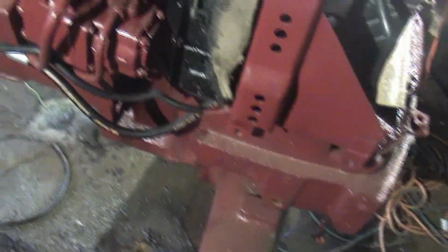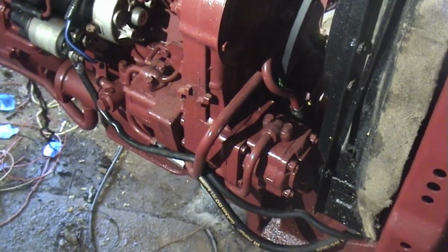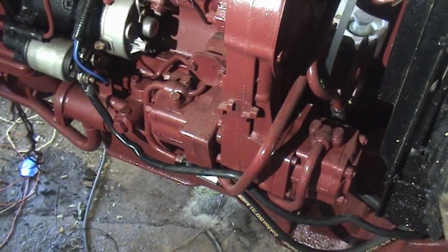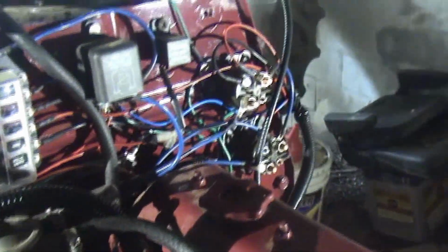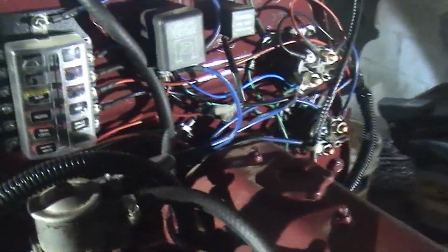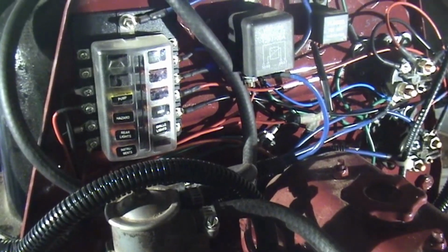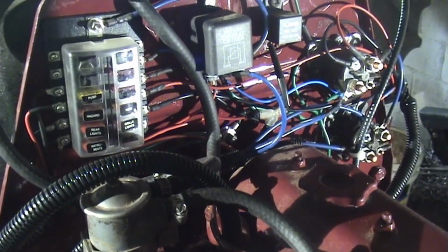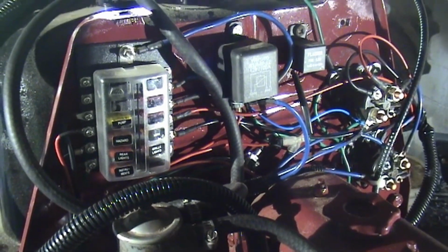Oh, let's see. This is new. So I took off every wire and replaced them all except one. This is the new single, 1 gauge battery cable to the starter, but all the other wires are new as well. But here's what you might call the firewall. I put on a new fuse block with 20th century at least, if not 21st century fuses, the little automotive push ones. You had these weird little fuse lengths that I've never seen before.